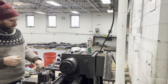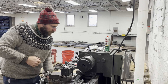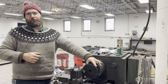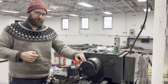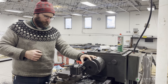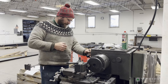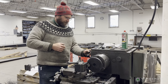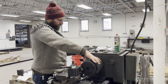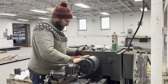We've got two things to do here: get the outside down to 6.125 and face it. Now we're working on a 6-inch diameter versus 3 inches before. If I try cutting at 570 RPM now, it's going to be way too much surface speed — it'll damage the carbide, won't have a good surface finish, and won't be productive. So I'm going to drop it down about half. This lathe doesn't have a massive gearbox — only 16 steps — so I'm going to go from 570 to 340 RPM. My only other options are 210 or low range at 254, but 340 is going to be good. This isn't a super high-precision part.